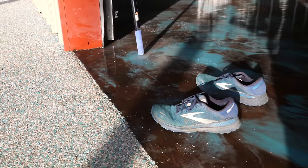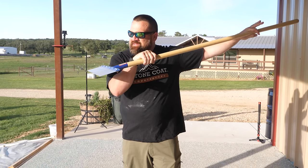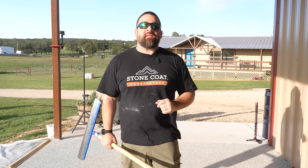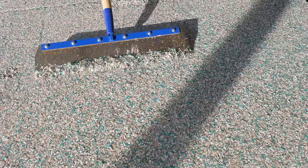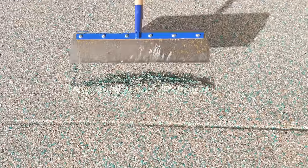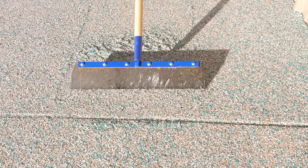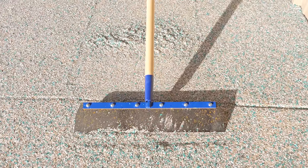We're back — it's the next day and we're ready for the next step. I'm going to use this floor scraper with very light pressure at a nice shallow angle to scrape off any loose flakes. We'll sweep those and bag them for the next project at Kenny's shop. Then it's time to apply the polyaspartic top coat. Note: there are grout lines we left in, so when you get up to the grout, just pull your scrapes away and get even more shallow to avoid pushing flake into them.